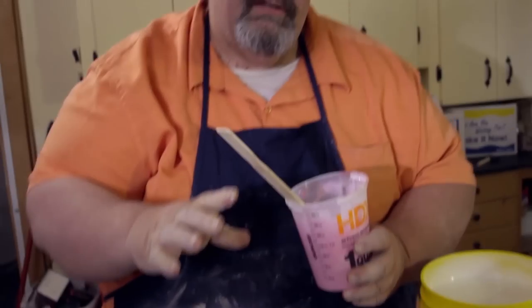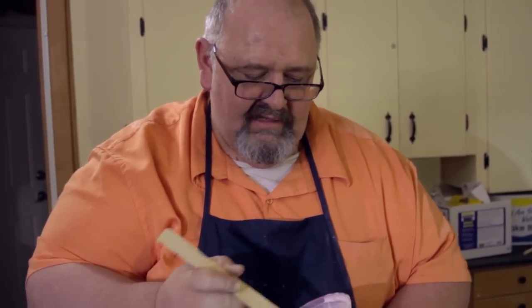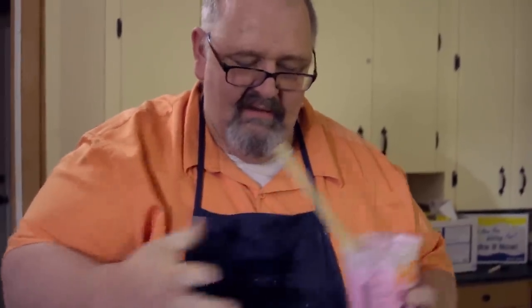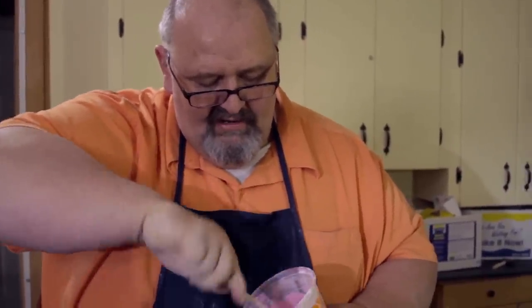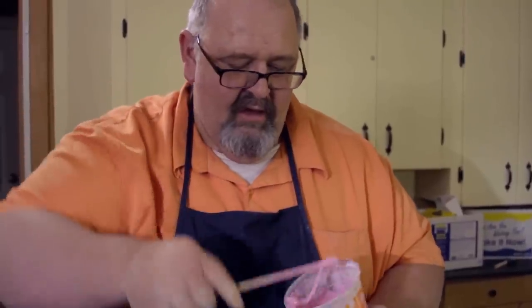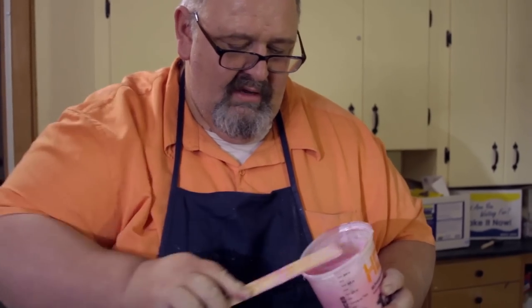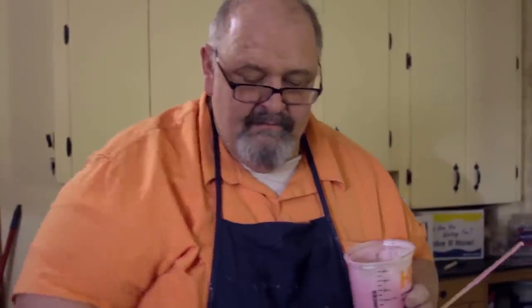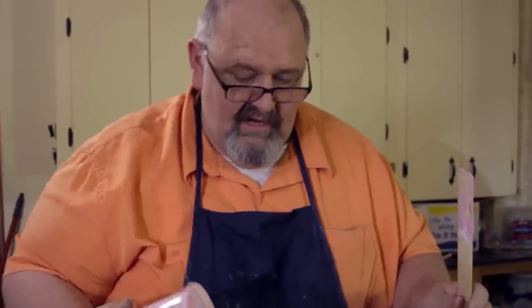Now, in a professional studio, they would likely vacuum this and pull out all the little teeny micro air bubbles. But because this is just a simple, basic mold for hobbyists or somebody getting into the trade, it doesn't necessarily have to be that way. We're going to brush this material onto this piece, making sure we don't get any air bubbles on the surface by using our brush. And we don't want it so thick that we can't see the surface through the silicone on the first layer.